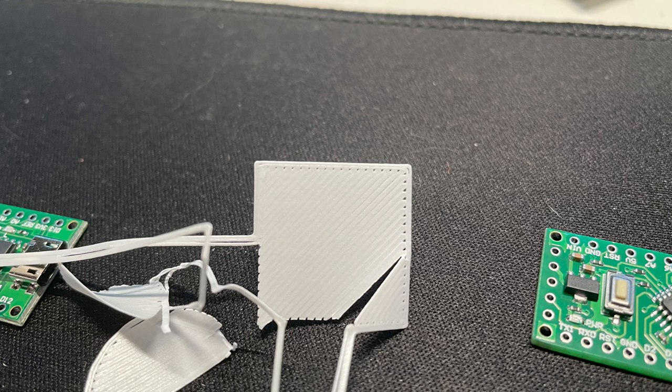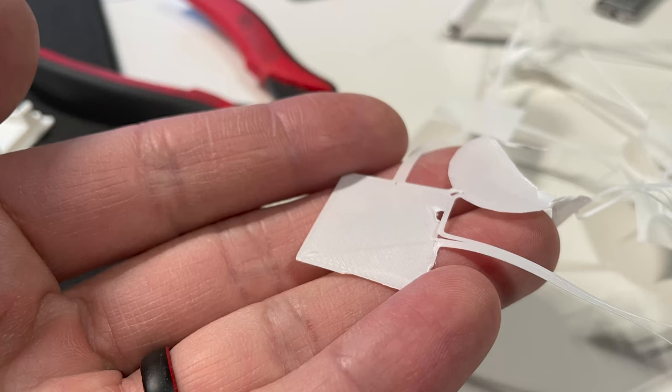Here's the print completed at 30 degrees bed temperature, basically room temperature. Before starting this experiment I raised the gantry height by about 0.06mm, based on what I learned from the 80 degree print where filament got squished into the bed. Sure enough, we're not seeing the rough texture on the infill. We are seeing a bit of the opposite problem — gaps between the outline and the infill — which might be the trade-off from increasing nozzle height, or possibly my extrusion ratio being a little low. The gap is worse on the right side.